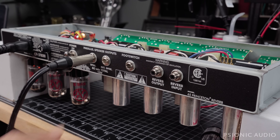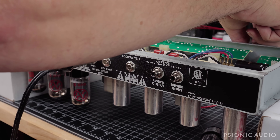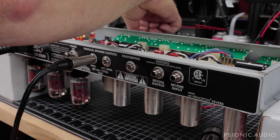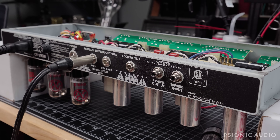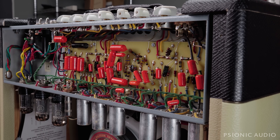I really think we're just a new pair of 6V6s away from this thing working just fine. Let's quickly test the existing preamp tubes and the pots. Everything seems okay and the owner did not report any problems. Once I get the new output tubes in here and set up, I'll triple-check full operation. But that tube is toast. And we've got pretty much the exact same situation with this Victoria Silver Sonic that was on the channel about six months ago, also reporting red-plating output tubes.